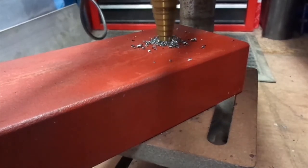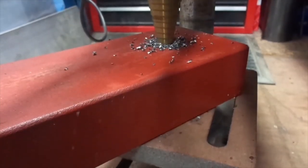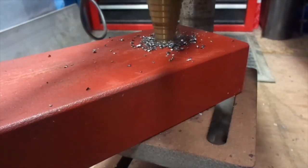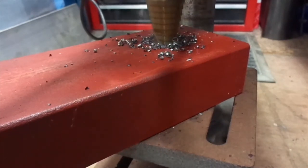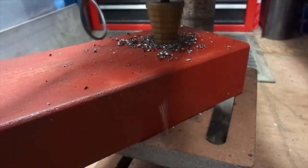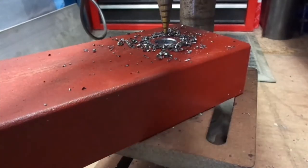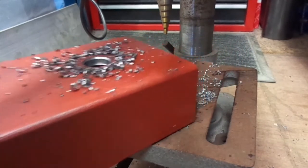We're making chips, you can see the cutting. Cutting fluid is just smoking a little bit — it does get warm but it's not overly hot yet. Four steps away from the mark, three steps in. The pressure started to get quite intense so I didn't want to burn the drill. What was happening was that I was actually trying to cut two steps at once. Each step is actually thinner than the thickness of the C-section metal, so you can see I'm trying to cut two steps at once which I'm not happy about.